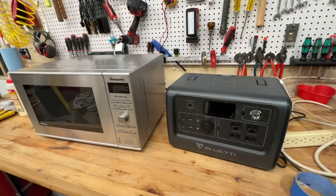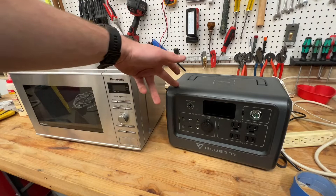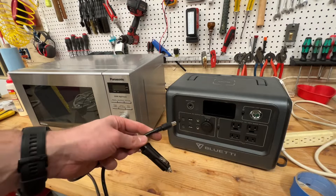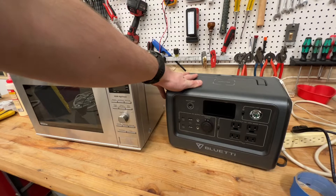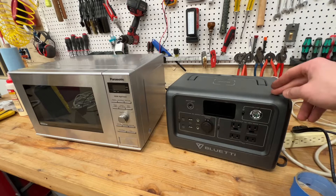Here's what I've got going on: I've got the Bluetti EB70 — I think it's the 70S. These days they call it a solar generator, but it's really a battery that gets charged by solar, a 120-volt wall adapter that comes with it, or what I've been using — a cigarette lighter plug adapter, which gives me about 100 watts of charge. This battery's inverter can put out 800 watts continuous, with a peak probably around 1,400 watts for a second or two. The capacity is about 720 watt-hours.